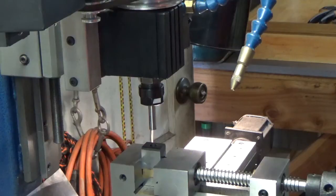The flute distance on those three-sixteenths mills is about three quarters of an inch. I've got to go down past the flute distance, but it's just a little over three quarters to the spring hole in the clapper, so that may work out okay. I'm going to give that a try this morning — I've got it lined up, so I'm going to load the software into the computer, get the three-sixteenths tool bit in there, and zero it out on the surface.